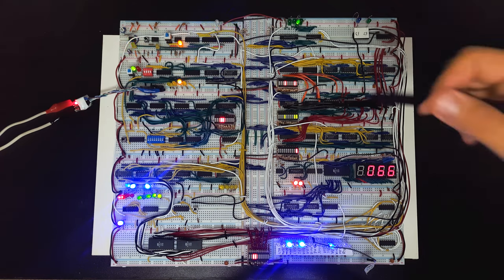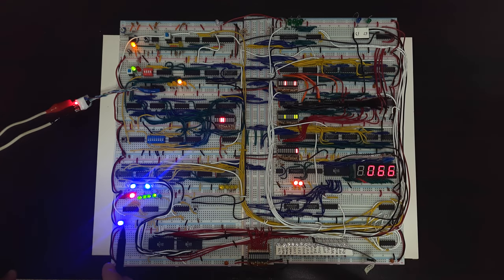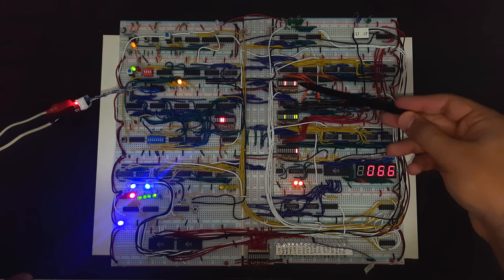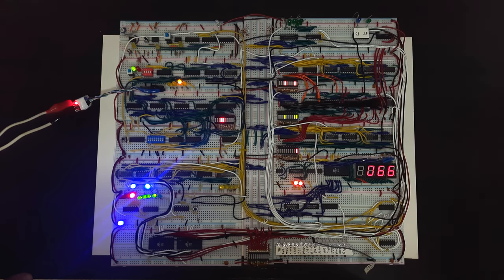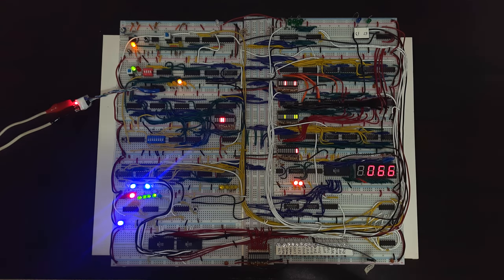In our case, if I pause the clock for a second — we have this counter here. It counts for each instruction cycle. So in our instruction we have a maximum of five cycles, and it tells you which cycle of the instruction we're on. For example, if I have to read something from memory and then move it to the A register, this could be done through a single command. It divides this into a couple of instruction cycles so we can do it efficiently without conflicting.